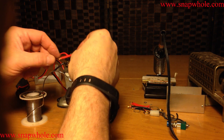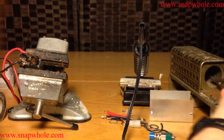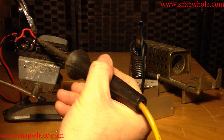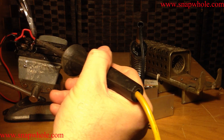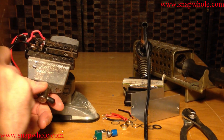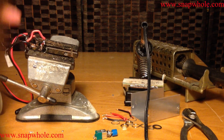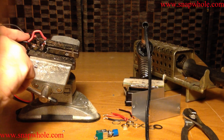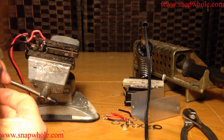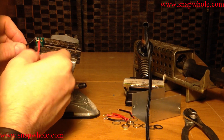I've got a couple of wires — go ahead and tin those. Now I've got them on there. I pull on them to be sure they're a good connection. The power goes to the center connectors and then power will be applied to each side but each side is reversed. I only need one connection since these are all wired together. I also need a push button switch to actually activate it.